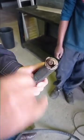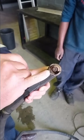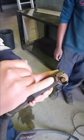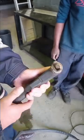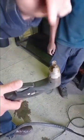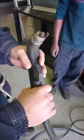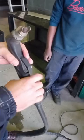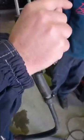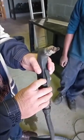You need to bring the machine back so that we can replace that tip — $600 for this whole little setup over here. So be careful when you're using it. Never cut upside down, because then whatever you're cutting tends to fall on there. If you really do need to cut upside down, you have to do it at an angle as you're cutting, so that whatever metal falls does not fall onto that tip.